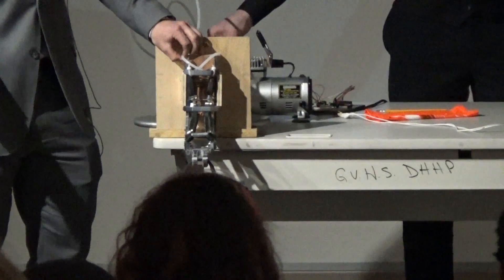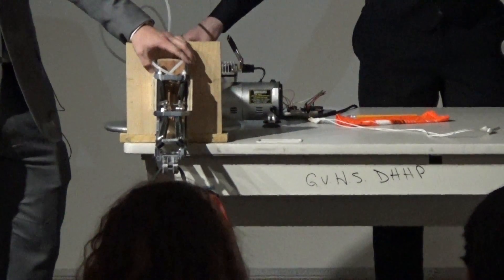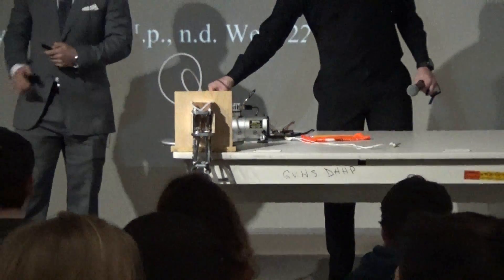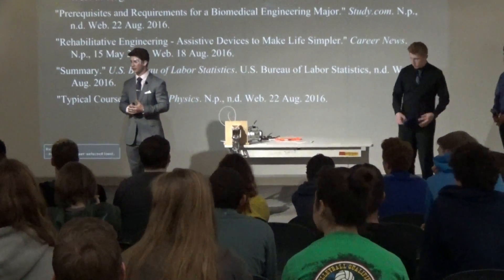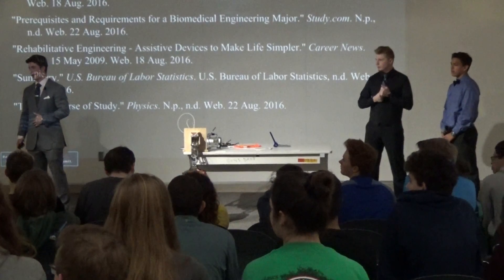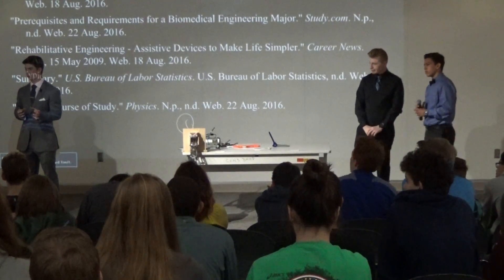Because of the scale model, it's just a component of the strength — it's not straight vertical, so it's the cosine of the angle times the normal strength, not the full strength. On the full scale model, I could have more individual air pockets, which would increase the contraction and strength. The full scale model could lift between 25 to about 40 pounds, depending on the size of the muscles for the individual. One problem is we'd need to design it with measurements tailored to each individual.